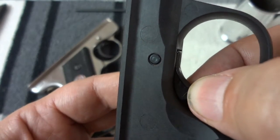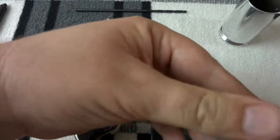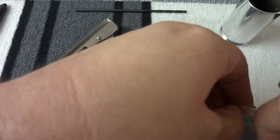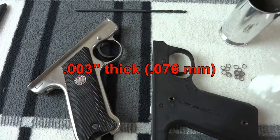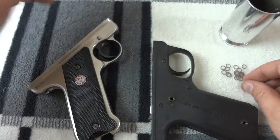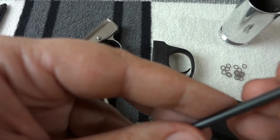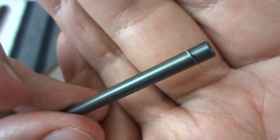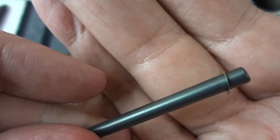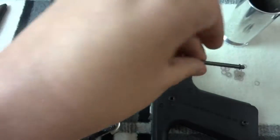You can see that pin moving around. What I'm going to do is try and clean some of that up. This is really a gunsmith job — I'm just going to show you it's possible. These are shim washers that are very thin, and I'm going to use those to shim up the play. You can see they go on and will eliminate play in the parts.